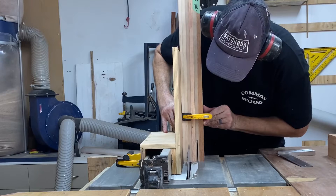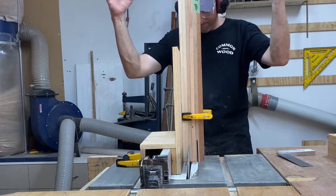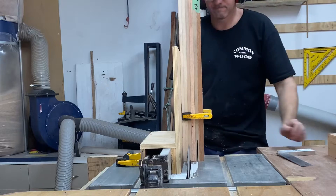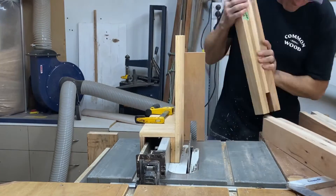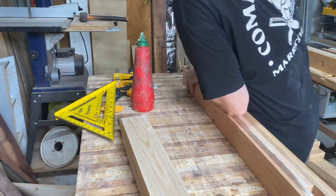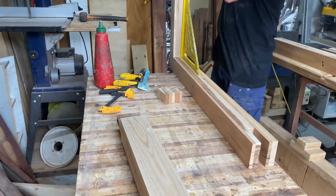Normally when you want to make something smaller, you wind the fence towards the blade. And this is me realising that if you're inching towards a line, you need to turn the blade the other way — and also me hitching up my pants because that's what you do when you feel like a dickhead. I reset myself and got the next few pretty much good to go. The next couple were actually a little too tight as the first couple were probably a little bit too loose.